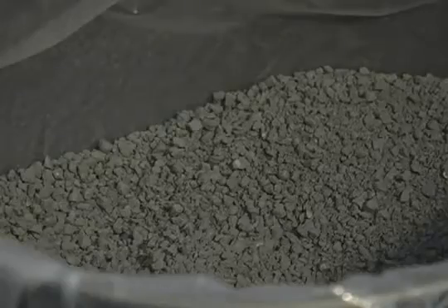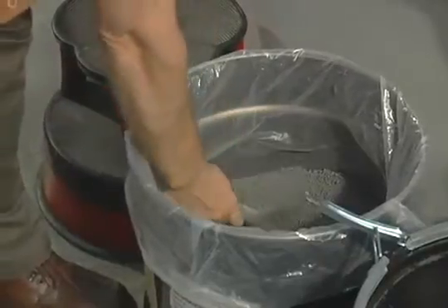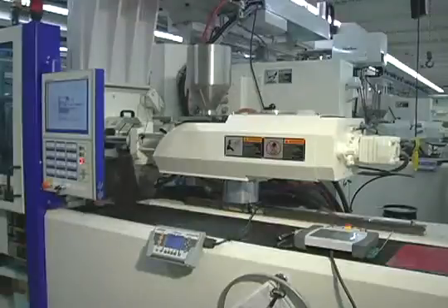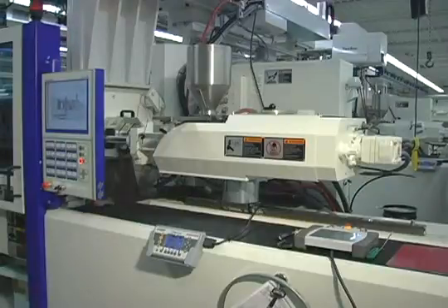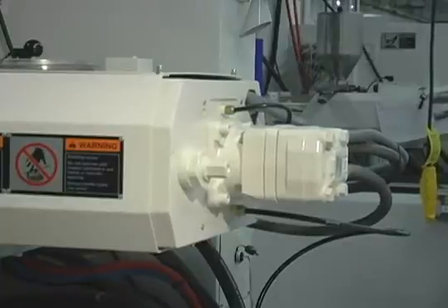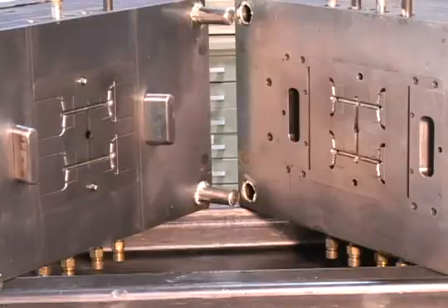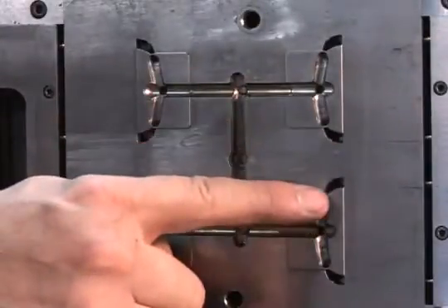Once it is cooled, this mixture is granulated into pellets to form the feedstock for the injection molding process. On the molding machine, the feedstock pellets are loaded into a hopper from which they are gravity-fed into the machine's barrel, where shear heat created from the turning injection screw melts the thermoplastic binder, turning the feedstock to the consistency of toothpaste. A reciprocating screw then quickly forces the material through openings called sprue, runners, and gates into the custom mold of the component being fabricated. The typical mold is made of two sections with plain surfaces that meet to seal off the cavity. As shown here, the mold may consist of multiple cavities, enabling a number of parts to be produced in a single cycle.